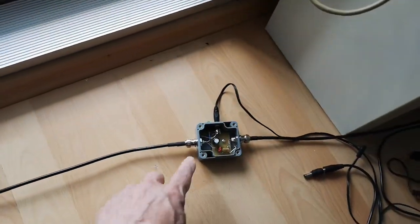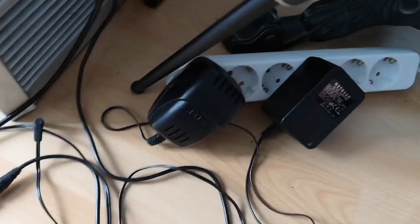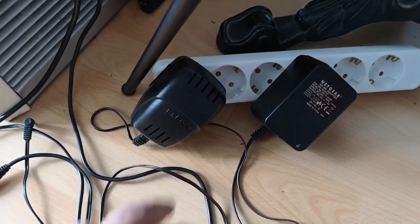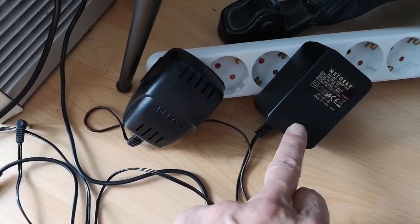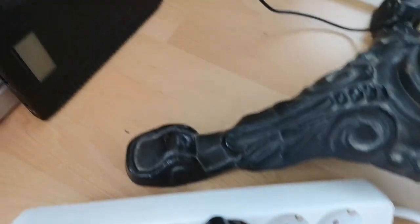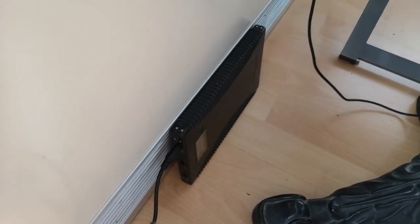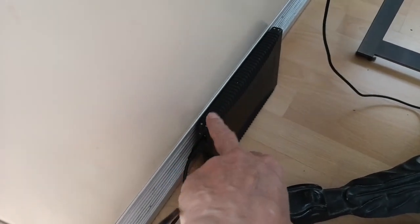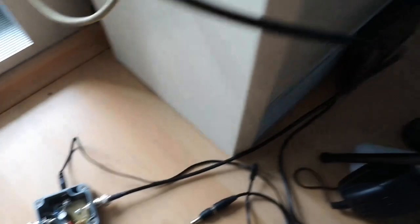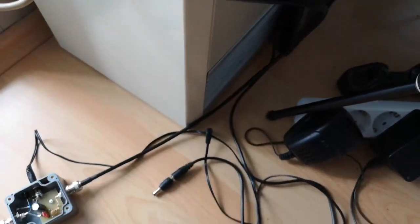The MiniWhip PA0RDT cable comes into its power injector — I've taken the lid off because I've been playing with moving the jumper around and trying various power supplies. It needs 12 volts nominally. I've tried an analog low-noise supply that came with it, a Netgear analog supply which produces slightly less noise in some situations, and a Power Gorilla battery pack. The battery only outputs 8.8 volts continuously and has a switch-mode supply inside, so it generates noise. I noticed that if I place the power injector on top of the battery, it picks up noise from the battery itself. Noise is the biggest problem when listening at very low frequencies.